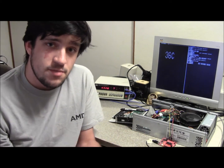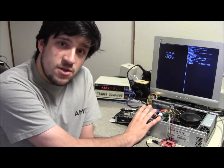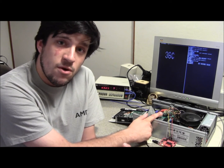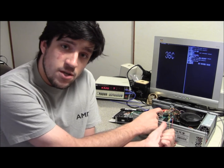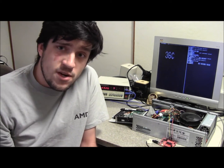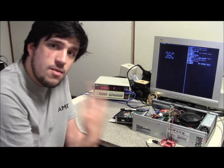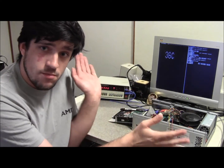This has been Kenneth giving you a basic conceptual introduction to proportional-integral-derivative control, showing you why industrial kiosk computers even at $25 aren't such a good deal, and the basic outline of the operation for my MSP430 fan controller. In the blog post associated with this video I will give you several close-up shots of the MSP430 control board, the schematics, and the source code. Feel free to go pick up a Launchpad, build this into one of your computers, and start playing with the PID algorithm in the firmware. I was originally going to take the thermistor reading and feed it back through an RS-232 port, but I ran out of space on the board — that would be a good extension so your system can talk to the fan controller, where right now they are two completely separate systems.